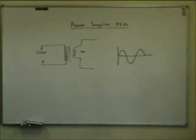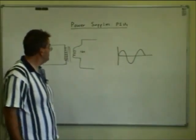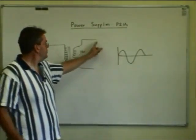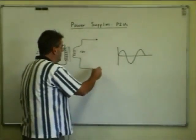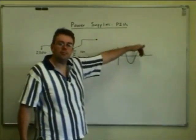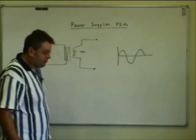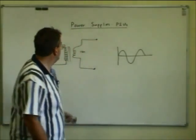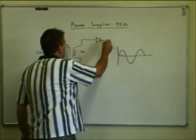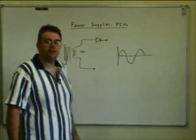So we'll take the next step. We've got our 230-volt supply stepped down to a typical voltage of around 16 to 18 volts. The only problem is the output is alternating current — if we look at the terminals, the current is swinging plus and minus, going one way then the other — no good for electronic equipment. We want DC.